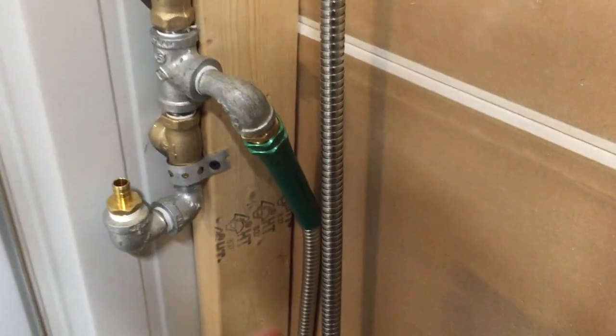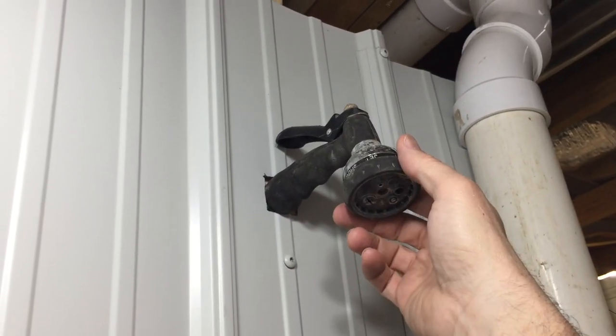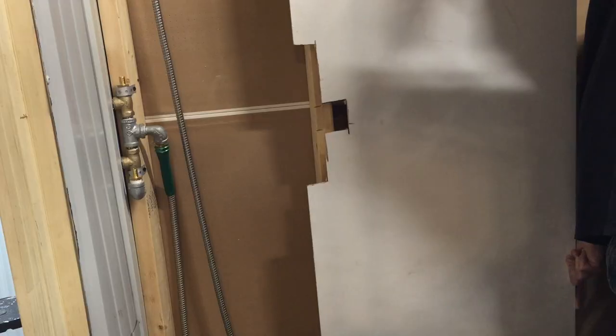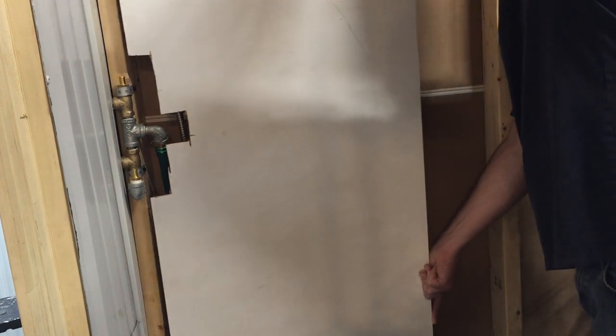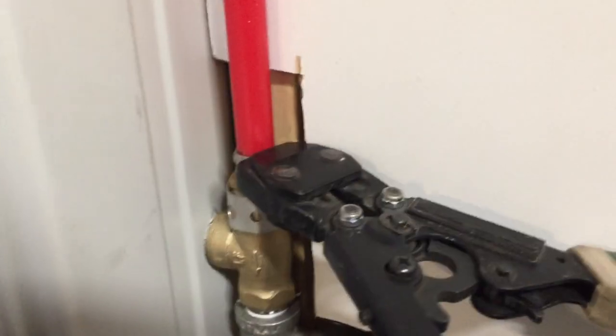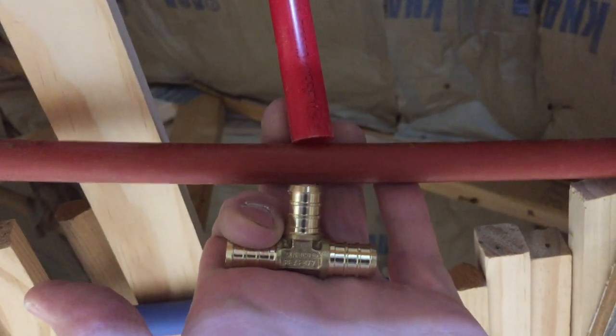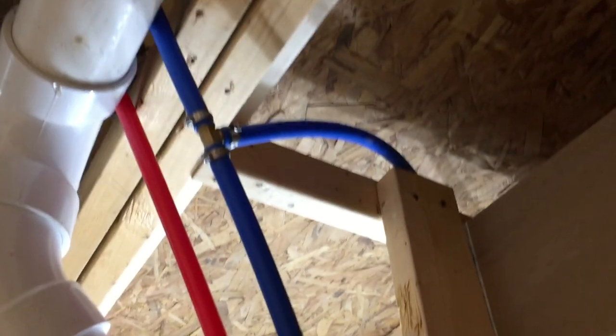We attach our garden hose here and I got a really flexible metal one that loops down like that and goes up and out the shower hole, so I can pull out my shower head and use it as a sprayer. We'll cover that with some scrap paneling so it doesn't get tangled. PEX hot water line, squeeze connector, and squeeze. On the other end I'll tee into my sink hot water feed line. The cold line goes the same way except it tees off to feed the toilet.